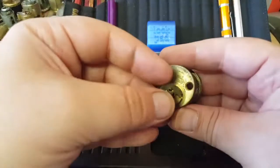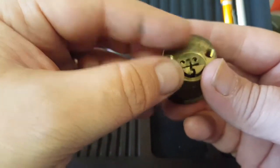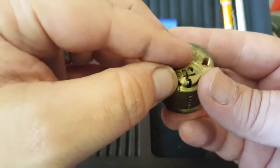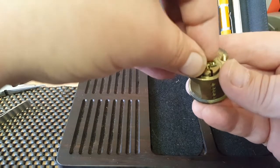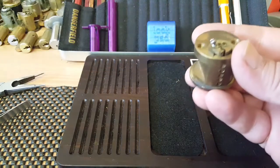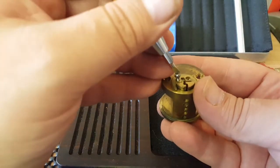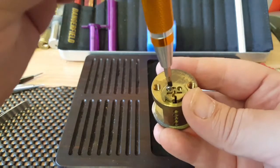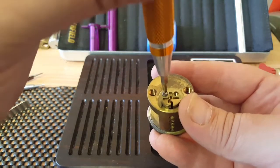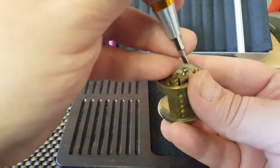Now with the back of these locks, they normally come with clips like this. They're just a simple set of screws, and you can just unscrew them off very easily. As you know yourself, if you had disassembled this lock, you know where these would have come from, but you just gently screw them back on. You don't need to put them on tight, you don't really, just nip them tight. You don't need them any more than that, because you're just going to cause your core to bind up a little bit, make it a lot harder to pick.